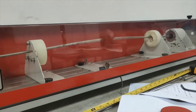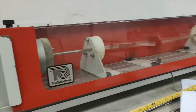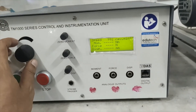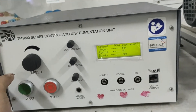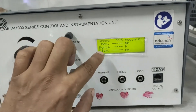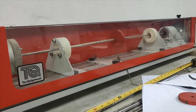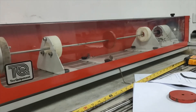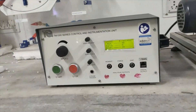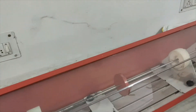If we keep on running this way, the shaft may permanently get damaged and the bearings also get damaged — the whole setup will vibrate. We have already got the value: 990-992 RPM. This is the whirling speed and critical speed. Now we will decrease the speed. We have got this critical speed value of this shaft in loaded condition. Now we will do the next experiment in unloaded condition — without any load on the unloaded shaft.